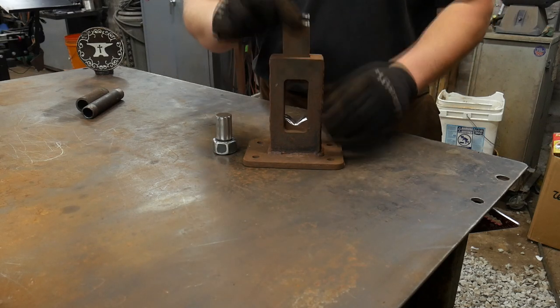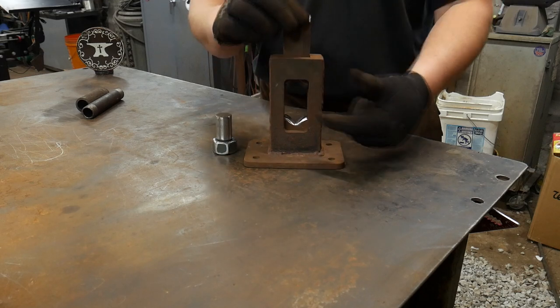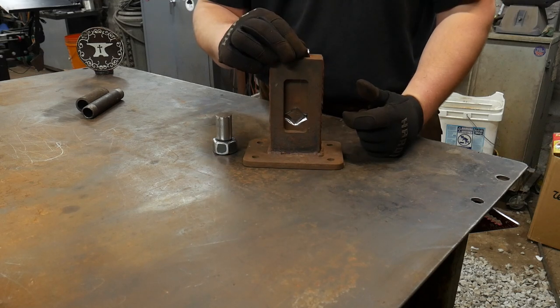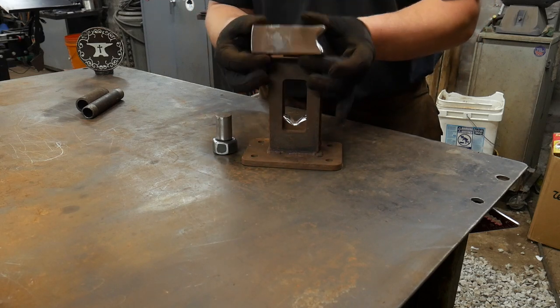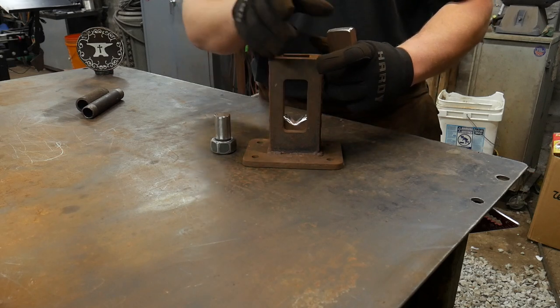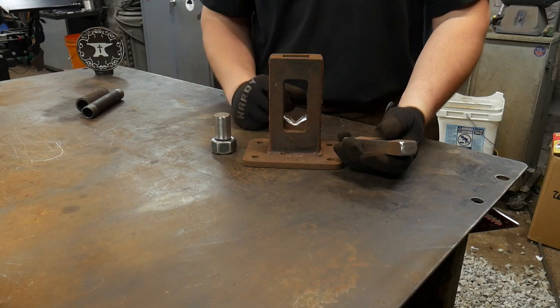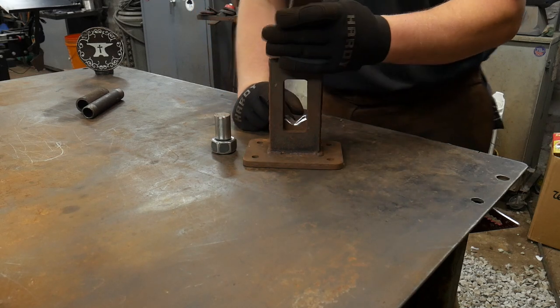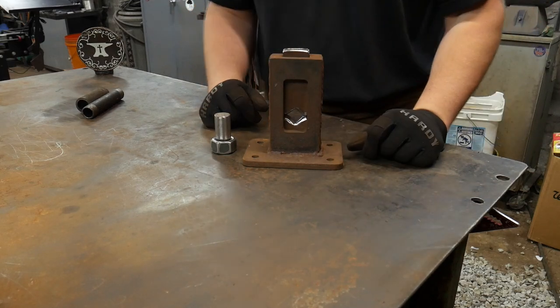Most of the time, the fly press is going to be used in operations where a guillotine tool might be handy already as it is. And so it's really cheap and easy to get smaller die material like this than having to build something out of big blocky dies and build up to where you can do the same thing as what the guillotine tool would do in the first place. So that's kind of my reasoning or my thinking behind it. We'll see how that turns out after a little bit.